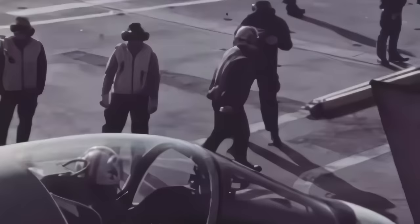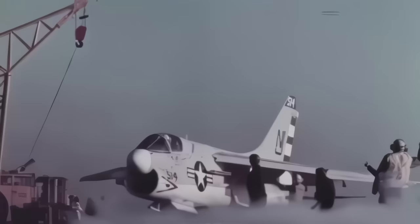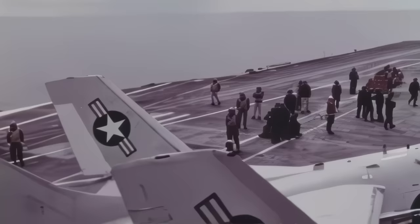Check the weight board to verify the gross weight. Your takeoff checklist should be complete before taxiing onto the catapult. UHT is trimmed 4 degrees nose up. Approach the cat track slowly. Ride the brakes lightly and evenly. Nose gear steering should be engaged.